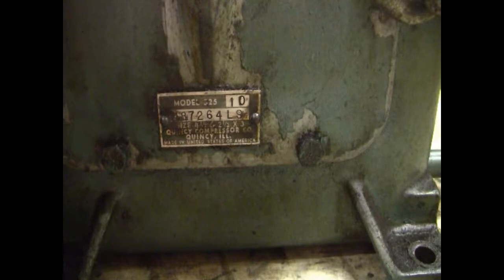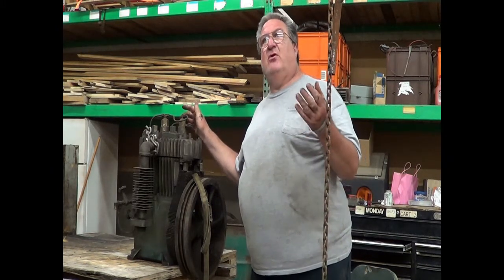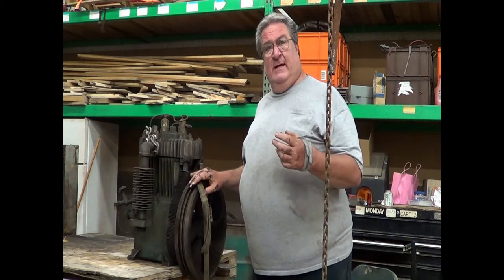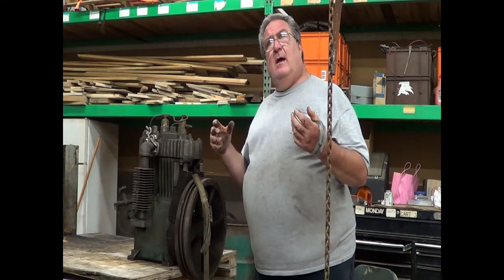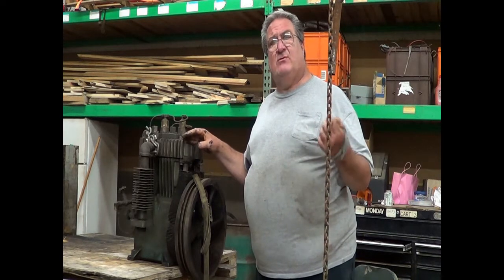What you're looking at here is the tag on the compressor — it's a 325, and up in the right-hand corner you see 'Record of Change 10.' Anytime you're ordering parts for a Quincy reciprocating compressor, you need to know the record of change. It tells you what type of wrist pins are used inside, which oil pump it has, and a whole lot of other details. Every record of change means they changed something in the build material, so this is a Record of Change 10 and that's what we ordered the parts for.